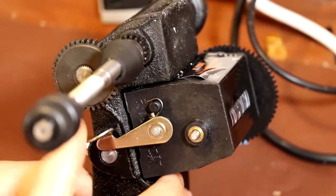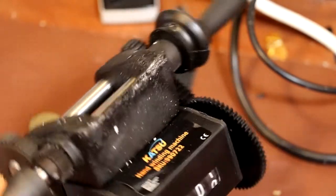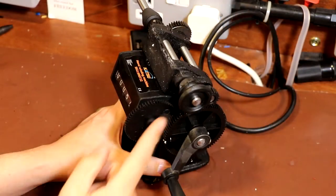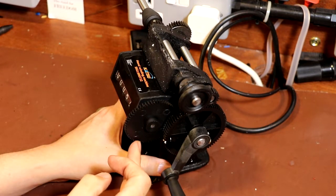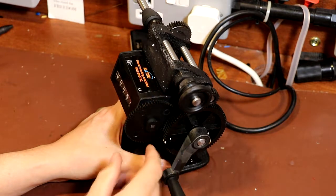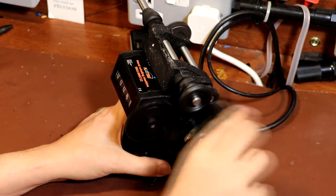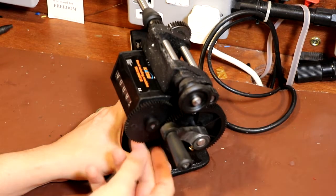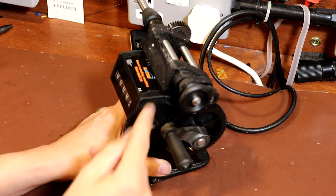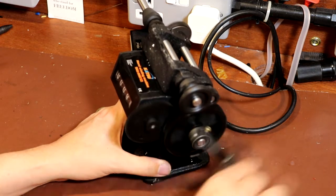So here's a little reset knob here, so when you want to reset your count you just press that and it zeroes it. So I think if I was going to use this I'd probably replace this counter mechanism though with one of these electronic counters, because I think a lot of this roughness that I'm feeling in the mechanism, I actually think it's in this counter mechanism that I'm feeling. Certainly the wheel that does the counting, again the plastic moulding is really poor on it. I can feel the edges of the teeth, they're kind of sticking out at all shapes.